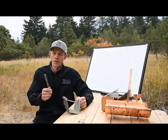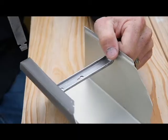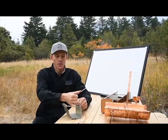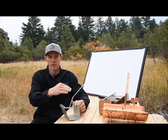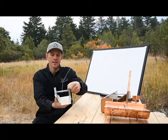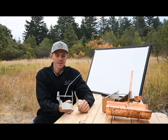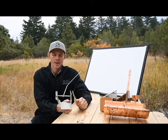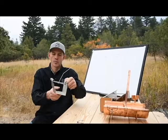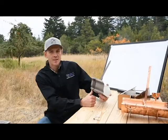Another option Raytech offers is the T-strap. These Raytech hangers have little oblong holes in the top in two different spots, and the T-strap is designed to twist in there and then go up onto your roofing. I usually try to slide the T-strap under the shingles so you don't see it on the roof. Screw your hanger in first, slide these in, then pitch the gutter to the desired angle and screw it up onto the roof. This is a good option if your fascia is questionable — maybe there's some rot or weak spots where screws aren't getting tight enough — or for steeper angled fascias where the T-wedge doesn't work.